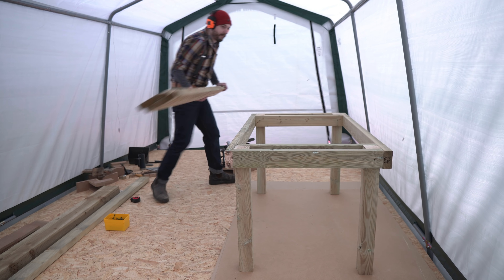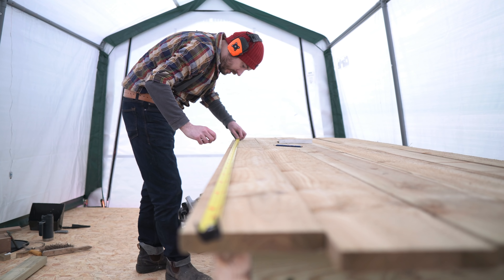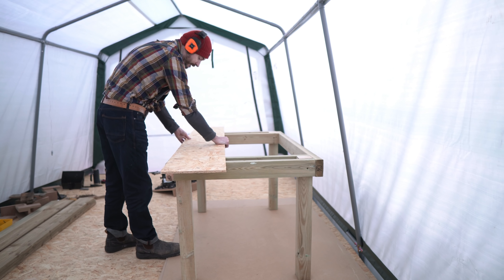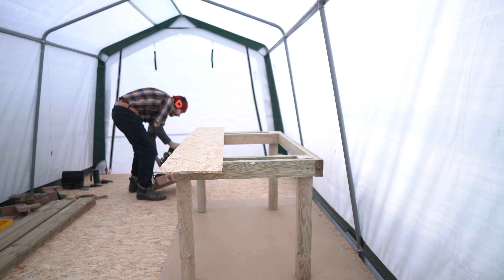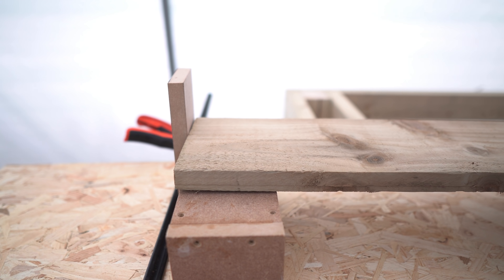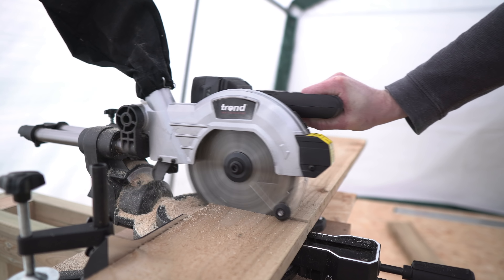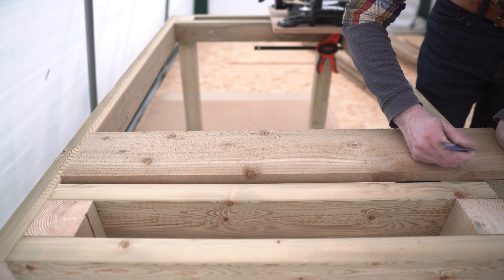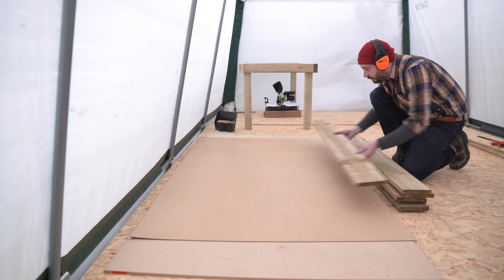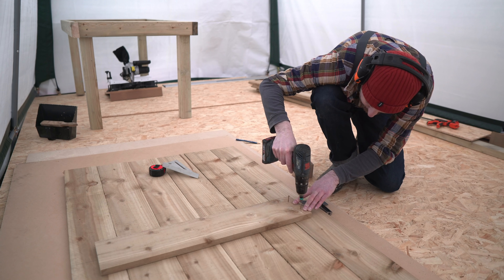I've got six pieces to make the table top and they're just going to be the perfect width without having to rip any down, but they're too long. I work out how long I want them and get them marked out. I set up a better mitre saw station using a scrap of OSB on the table frame with the mitre saw clamped into place, set up a stop block, and cut all six pieces to exactly the same length. I take one of the offcuts, offer it up to the table, mark it to fit inside the frame, and cut it down to use as a centre support. I lay out all the slats, put the support in the middle, centred, and screw it down to each slat from the underside.